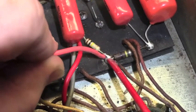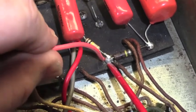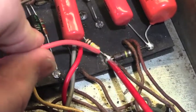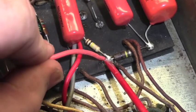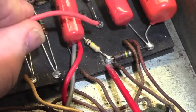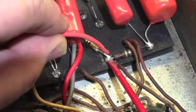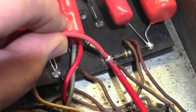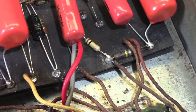I use 725 degrees for almost everything. I use a Weller variable control with a digital readout that's set to 725, and it's pretty much on all the time, and that's pretty much where I leave it set. So again, soldering iron, touch it to the work, with nothing on this eyelet, right? Then once the work is hot, you touch the solder, pretending this orange wire is the solder, you touch the solder to the work, not the iron, all right? End of lecture.